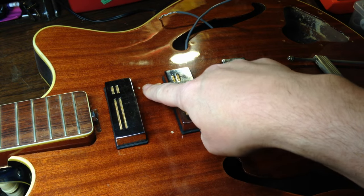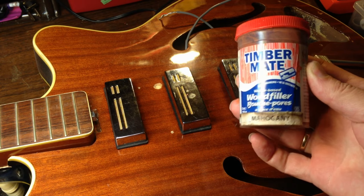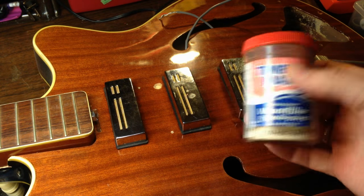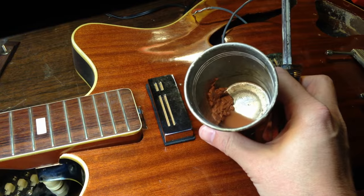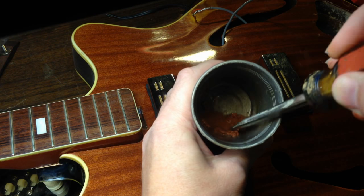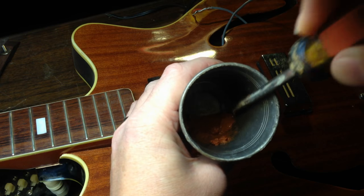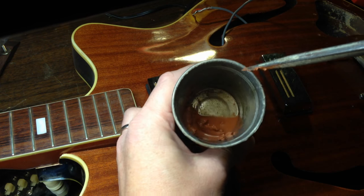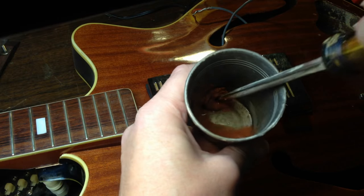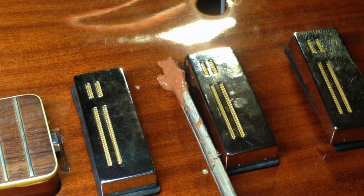In order to fill this hole and disguise these two little screw holes right here I'm gonna use some of this stuff. This is Timbermate wood filler. I will put links in the description to any tools or substances that I use in this video, so if you're interested just look down for links in the description below. Basically what you do is dip a little of this stuff out and mix it up with a tiny amount of water. It gives you a prescription for the ratio of water to product that you're supposed to mix — it doesn't take very much water at all. I'll at least get started here and then finish it off with something a little better.